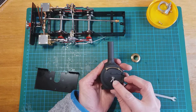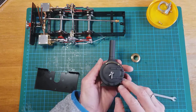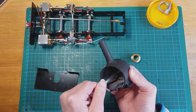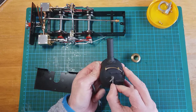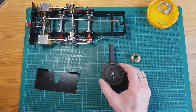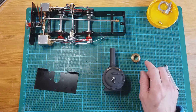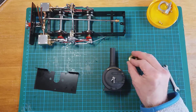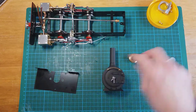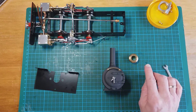The smoke box handle — the larger of the two handles needs to be pointing straight down. I haven't got a 5BA box spanner so I'm going to have to wing it with a normal 5BA. That looks about right — so there are two out of three fitted. The last one to put on is the brass chimney cap. I'm going to leave that until the smoke box has been mounted to the floor, as that gives me a better platform to attach it. The instructions say to use Araldite or similar, so I'll be using an epoxy.